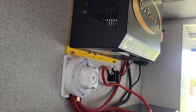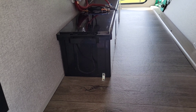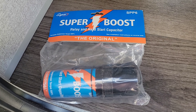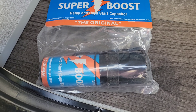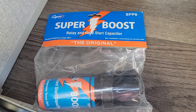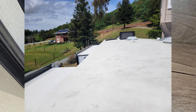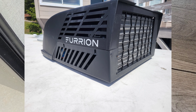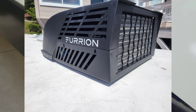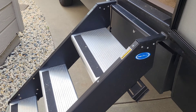3000 watt continuous power, which with the upgrades will run both air conditioning units. Some of you might speculate that's not possible. This is the other upgrade — these are about $15 on Amazon and it's a soft start for your air conditioners. So it's pretty easy to add on. You look at some instructions online, I can make a video if you want. So we'll move to the inside.